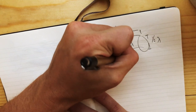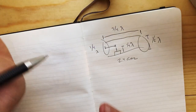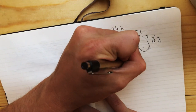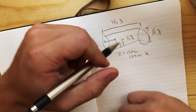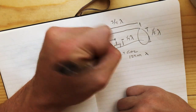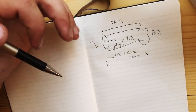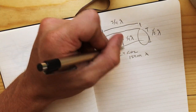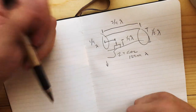For a 2.4 GHz Wi-Fi signal, the wavelength is about 124 millimeters. If we can line this up, we have a good placement for our active element, our can has the right size dimensions, and our wave is going to be able to get that constructive interference and boost our Wi-Fi signal.